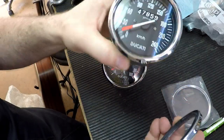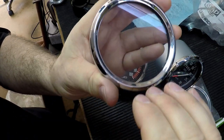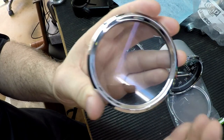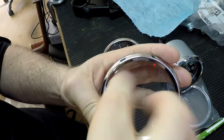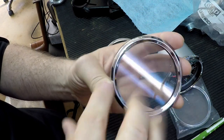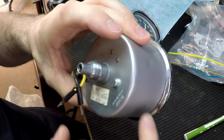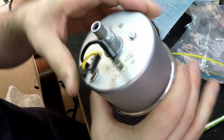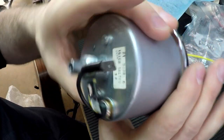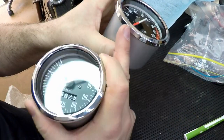The other difference between the remanufactured bezels and the originals is the originals actually have a tiny bit of a lip here where the metal comes down towards the glass — the originals then go out flat, very slightly. Mechanically that sort of makes sense — the stamping has a little bit of a rim, a little bit of an edge there. Other bezels on other instruments often have quite a wide one, so they have a wider surface pressing down on the glass and not just a sharp edge. So again, let's check the crimping on this. The same thing has happened — that rim is too wide and it comes up the side of the housing. On this one it's gone on rounder — there's no particular spot where it's gone bad. That's all right, that's all right.